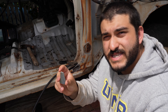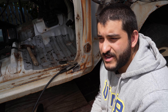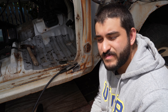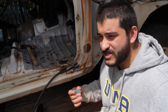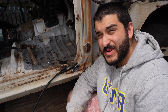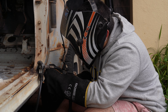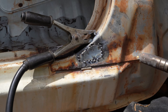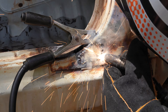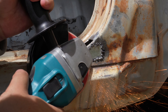Since our replacement piece is galvanised, when you weld, a little bit of the galvan will come off as zinc fumes and you really don't want to inhale them because it gives you a sort of flu. So I got a mask that should prevent that, and I also drank a glass of milk which is supposed to fill your body up so you can't absorb any heavy metals. I'm a complete novice welder so this probably won't look good, but as long as it holds together I'll be pretty happy. Now I think we've completely saturated the surface with welds — let's grind it back and see what holes we have left to fill.